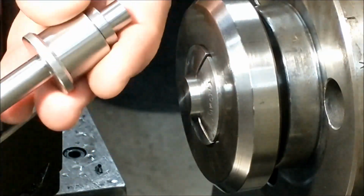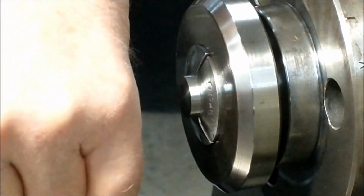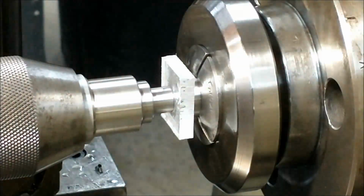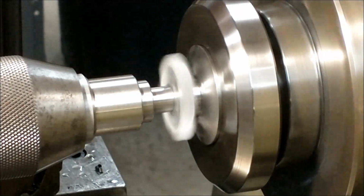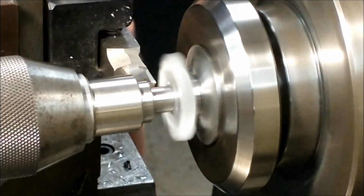This particular little attachment will act as a driving live center. You could use it as a center, you could use it as a pressure center, but it's going to keep you from digging into your checkbook and waiting for the UPS guy to drop off something. And it's a great project. Take you a couple hours to make one of these.